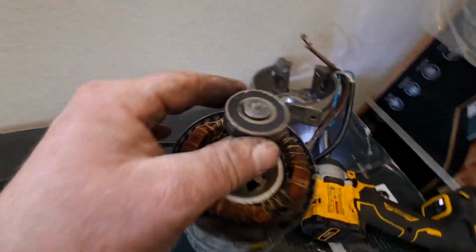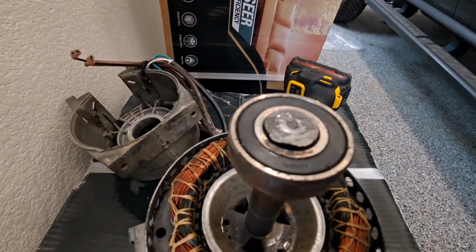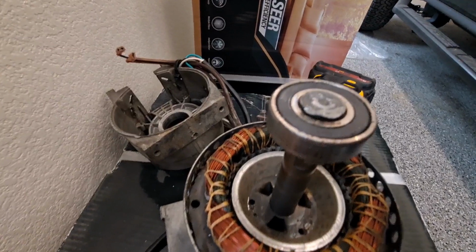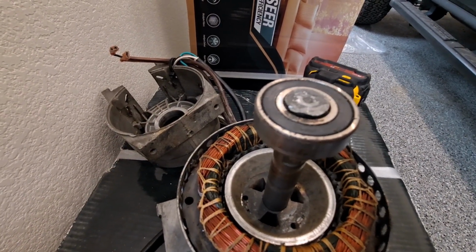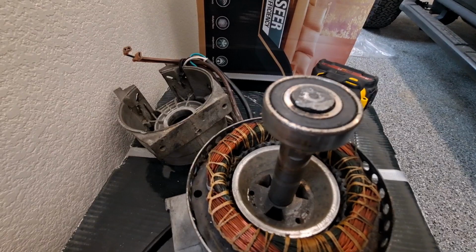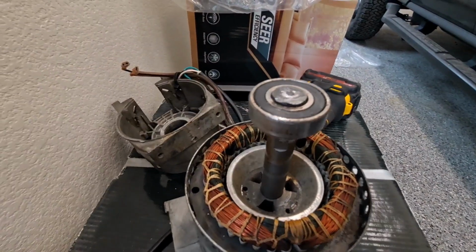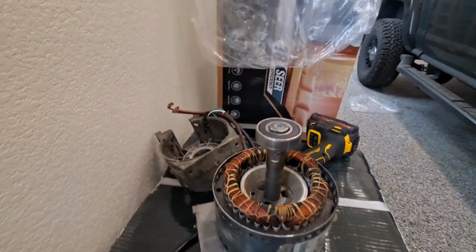It was looking good. Then it caught the edge, and the edge, if you look, it's a little bit mushroomed right there. See that? We call that mushroomed. That was because I smacked it with the air hammer to get a little bit of a crack. So I caused that. I didn't see it until the bearing stopped sliding. So what I should have done was filed that down. Now I'm a little stuck, but I got a plan to work around.